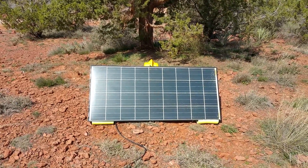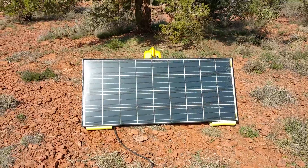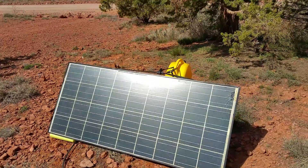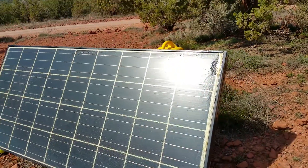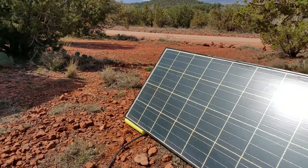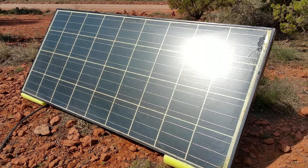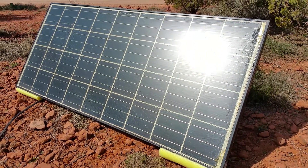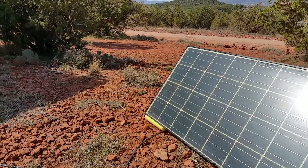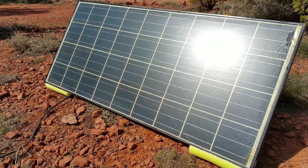After doing that review, I was trying to figure out what I was going to do to maybe help this panel work again. If you look, you'll see no cracks — there's a little spot here on the edge that looks like it was cracked but it's been filled in. I looked online trying to figure out how you can repair a solar panel's tempered glass. You can't remove it because it's laminated into the panel. I found that people were using polyurethane — a lot of weird stuff, silicone and such — but polyurethane stood out, so I tried it.